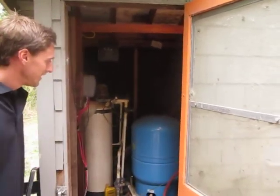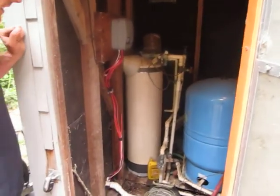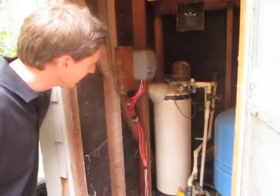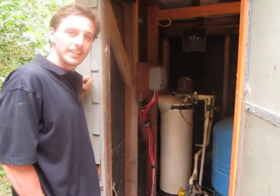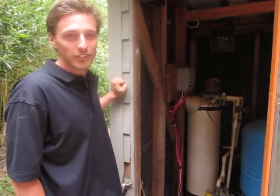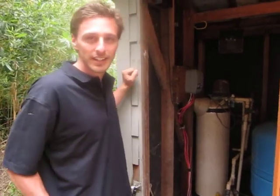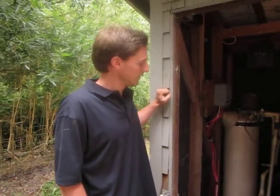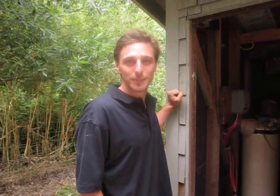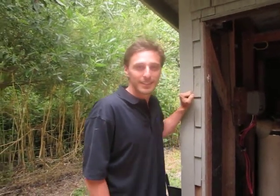This is another piece of equipment we inspect because at times the bladder inside the tank can fail. That one on the left — is that an old filter or something? That's an old media filter, probably sand to remove iron and manganese. Water softeners are more common. With water softeners you'll see a separate tank called a brine tank, which is the salt tank, because the water softener uses salt to regenerate after it's collected the calcium and magnesium inside the filter bed.